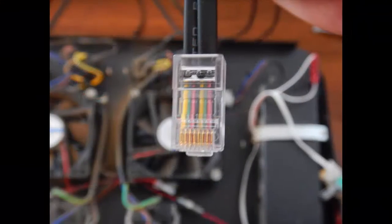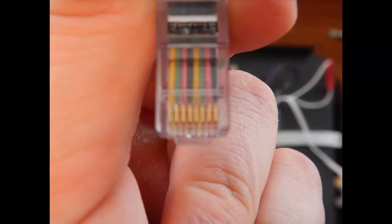For those who don't want to buy the Apex cord — they're a little expensive — you can make one using a network adapter. Starting from the left-hand side with the clip pointing down, the only wires being used are three and four and seven and eight. Three is the ground, four is the 0–10V, seven is the ground, and eight is the 0–10V. Follow the color wire accordingly.